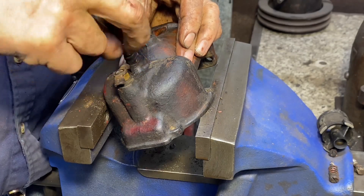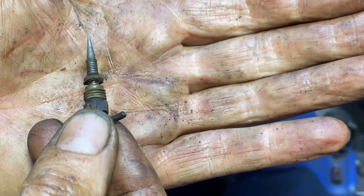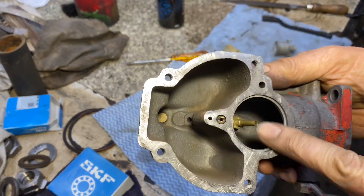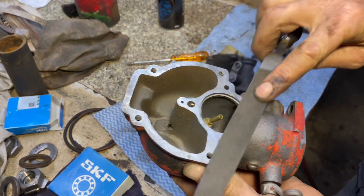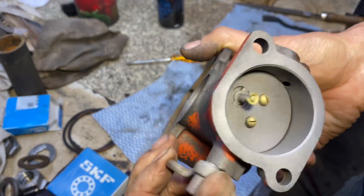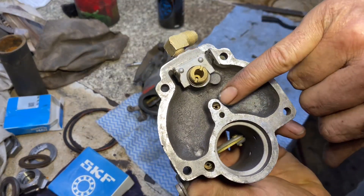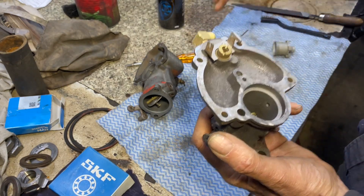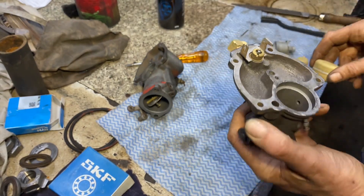Getting this out — this is the main jet, usually adjustable on these old tractors. There's a jet here and this fitting needs to be tightened up. I've cleaned it all out in there, and I'll file these nice and flat for the gasket. It's all cleaned up in there now — beauty clean, blown it all out. There's a jet there, a jet there, and the needle valve goes in there. Floats go back on.